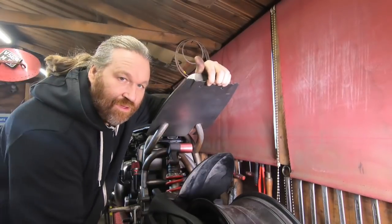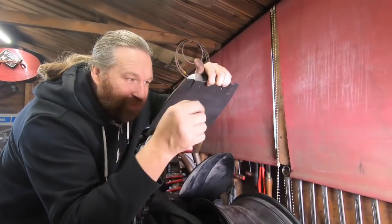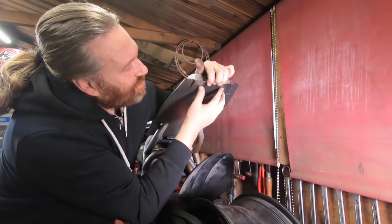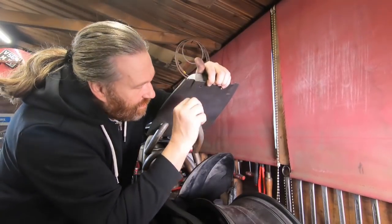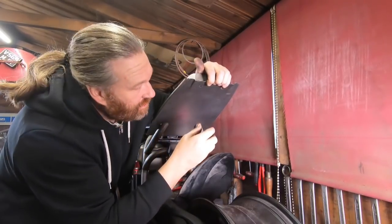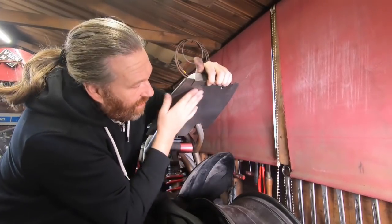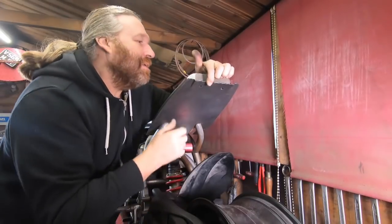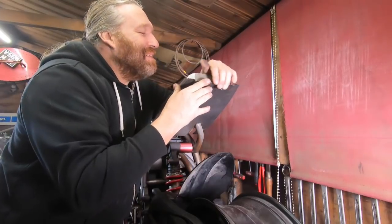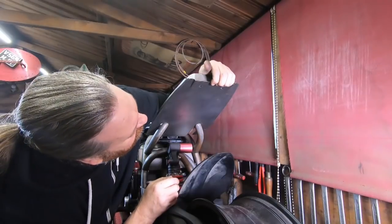I don't want that. Sort of like all the old rivets in a Land Rover. You've seen them where all the rivets are and the body is all buckled. I don't want that look. So I think what I'll do to get round it is do a little wedge in there to take up the space. Then it'll all have something flush to bolt up to, and we won't get that rippling effect like an old Land Rover. Nothing up with old Land Rovers, by the way. I love them. But I don't want that on this. Yeah, we'll do that.